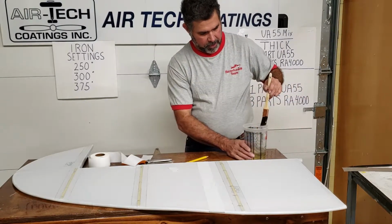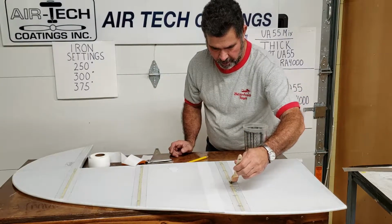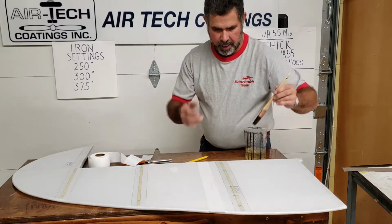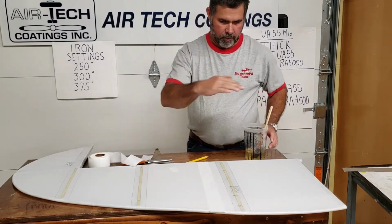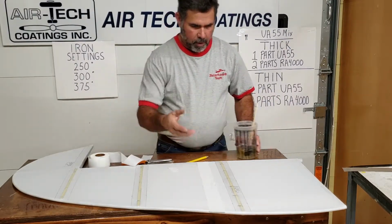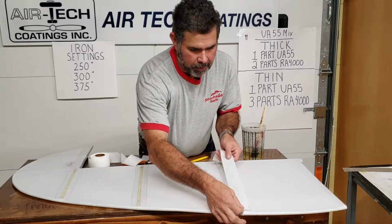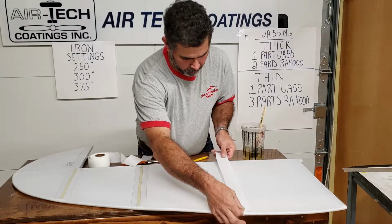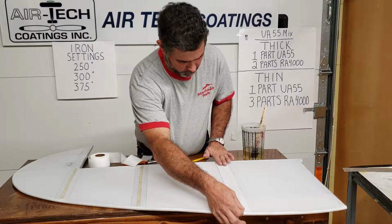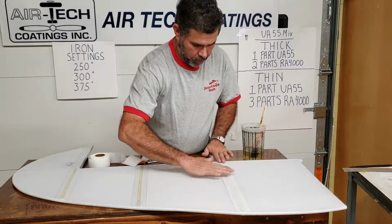And a lot of times when you're doing this down the long side of a fuselage, you just have to do it in sections, because you can't hardly go down the whole side of something long, or say the long edge of the leading edge wing where it comes over onto the open bay. You've got a lot to do. Do 4 or 5 feet at once. But once that's wet into place, just lay your tape in that. And like I mentioned before, your glue is reactivating the glue under it. So right now it's just like having 3 wet coats of glue, because you reactivated.